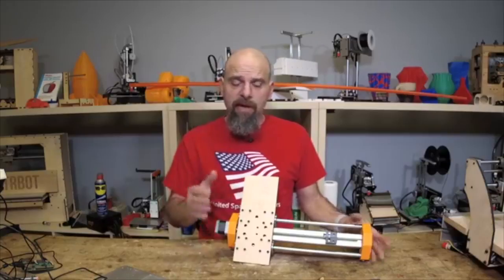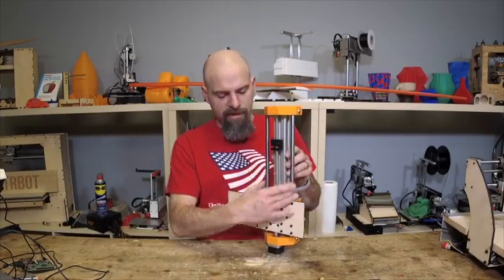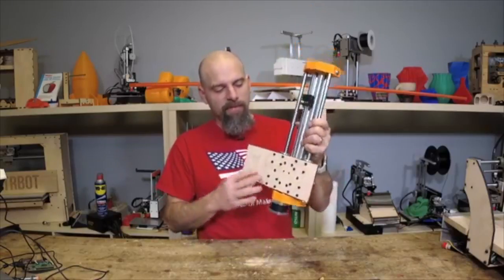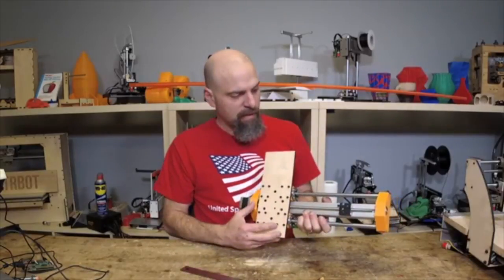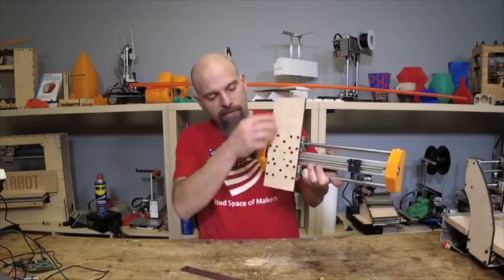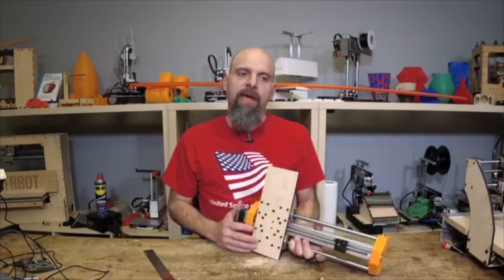And then the Z, I've gone back and forth on this. You know, if you turn this stage up, well, I showed you in the drawing. But in the drawing, I just use this assembly to kind of situate all of my other assemblies. So you do not need 10 inches of travel. The problem with 10 inches of travel is, the way I've designed this, the rails will be here for Z, and you have to give so much clearance underneath this whole gantry if you want it to reach down all the way. And if you reach down that far, you're going to end up too flimsy. So most people limit around 4 inches, and that is enough.